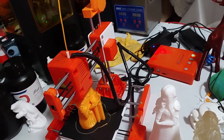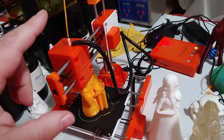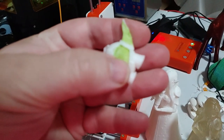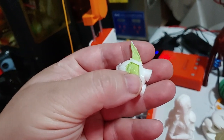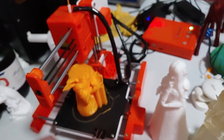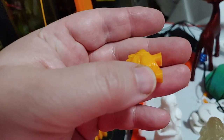But overall, very impressive — I really like what this printer is capable of. I did have a problem where it was squishing the first layers. You can see it here — it's what we call elephant's foot. See how those first few layers are a bit squished? That's especially a problem when you try to print higher resolution. But now notice this one's not squished, at least not as squished. I was tweaking and adjusting it.